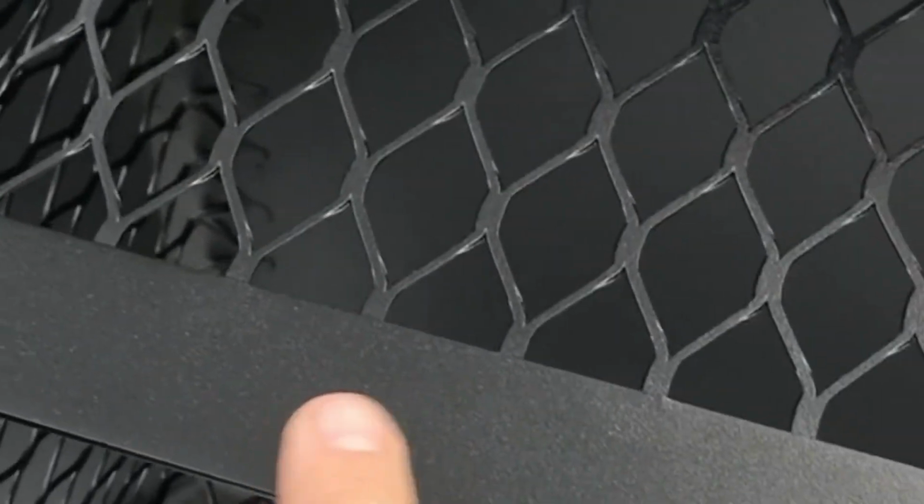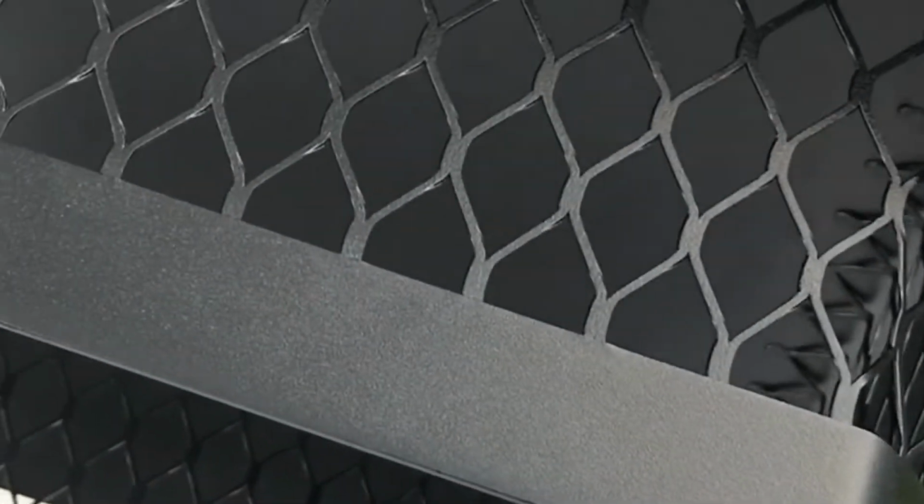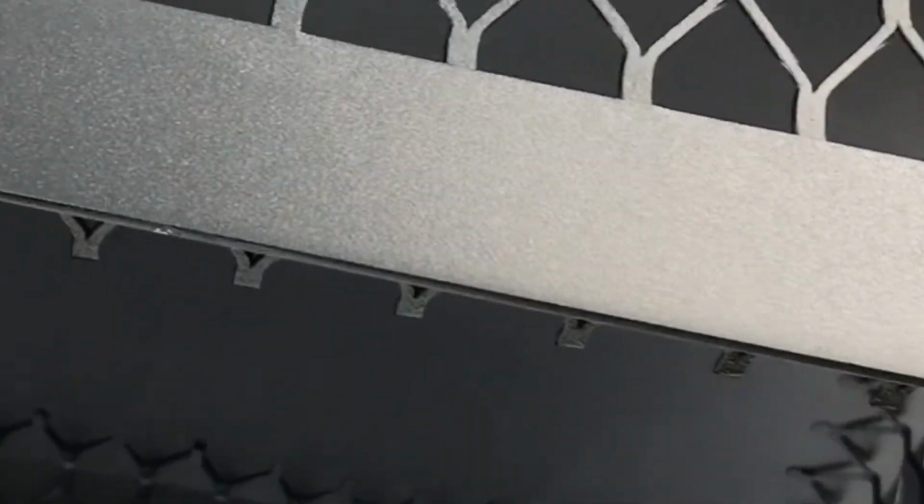Now if I tilt it up here a little bit, you see this piece here that goes all the way around. This is very standard. This is called your base. The base, there's a couple preset holes here in each corner. That's where these mounting screws go on. Generally, these bases will also, if you look inside here, have a little bit of screen flanged out, and this screen will sit on top of the clay flue tile. This chimney cap will sit on top of the clay flue tile.